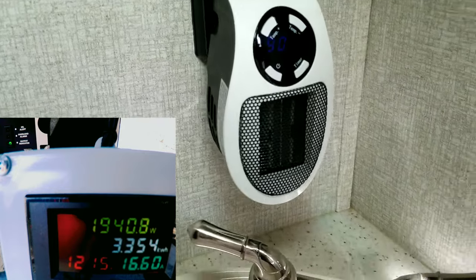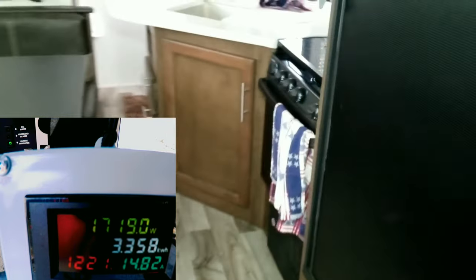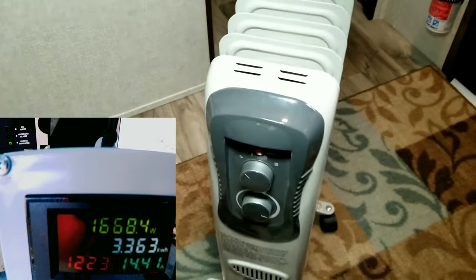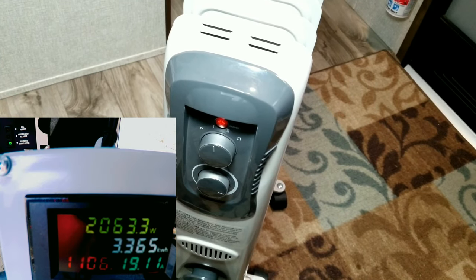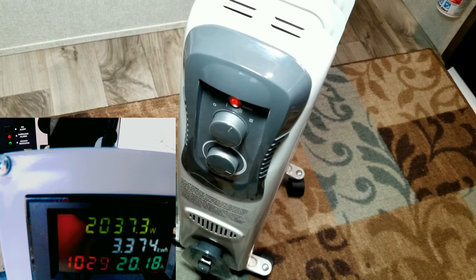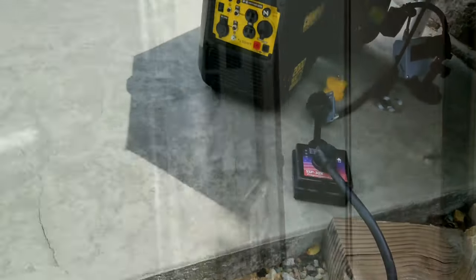The 350-watt heater settles at about 3 amps. Then we go to a 1,500-watt heater that can be turned on in three stages. This generator only runs 13.3 rated amps, but can run max load for about 20 minutes according to the manual. Turning it up and pushing the load causes the generator to kick off — everything shuts down. So we'll reset and start over, this time sneaking the loads up differently to see how the Honda handles it.